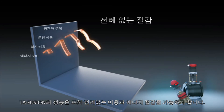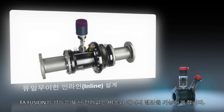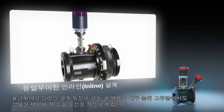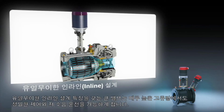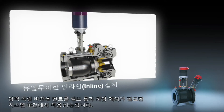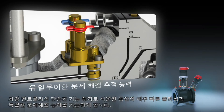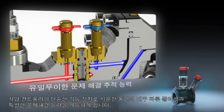TA Fusion's performance also enables unprecedented monetary and energy savings. Our larger valves feature a unique inline design which enables precision control and low noise generation even at high flows. A pressure independent version is available for system conditions where DP control is required across the control valve. Simple deactivation of the DP controller enables high speed flushing during commissioning and unique troubleshooting capabilities.